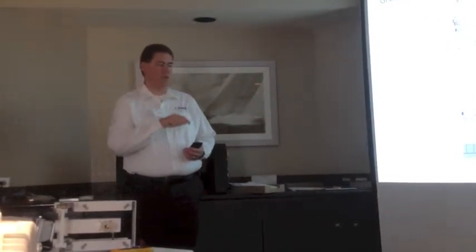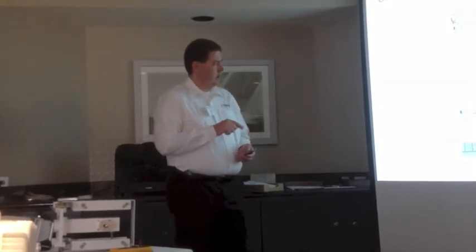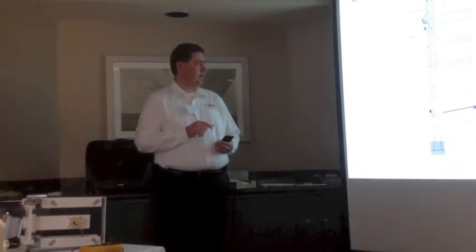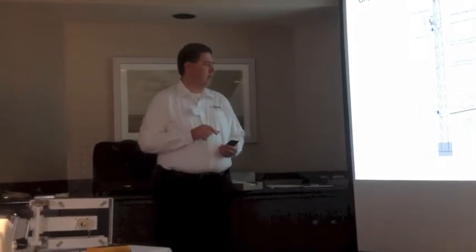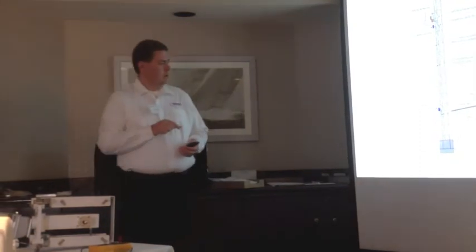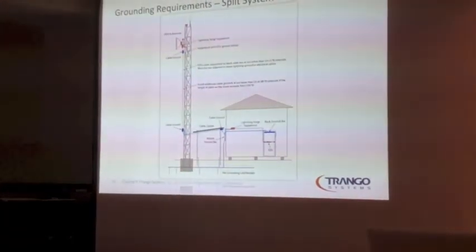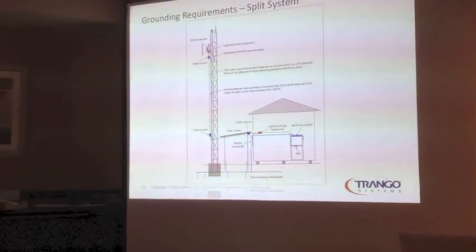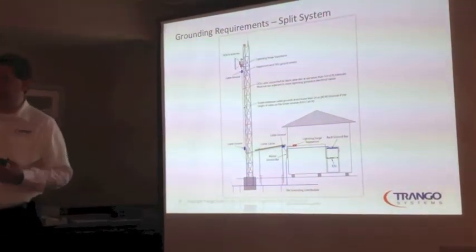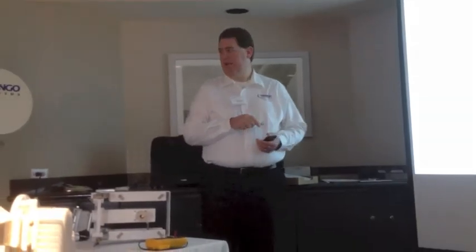As the cable's running up the tower, those long towers need more of those grounding units. The important thing to mention is that all of this grounding will do nothing for you if your tower is not grounded properly. We have some customers who go through all this painstaking effort to ground everything, and then later find out the tower at the bottom wasn't actually grounded to anything. Each leg of the tower should be individually connected to a buried ring around the tower with radials going into the ground for dissipation, and that should also be connected back to the same ground in your shelter. If you're renting space from somebody else, check the grounding — make sure copper thieves haven't come through and stolen it.